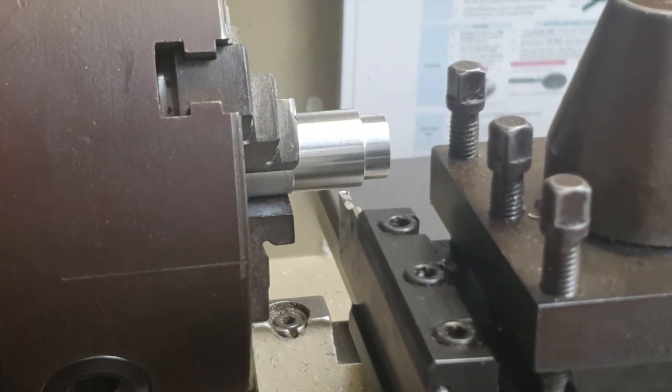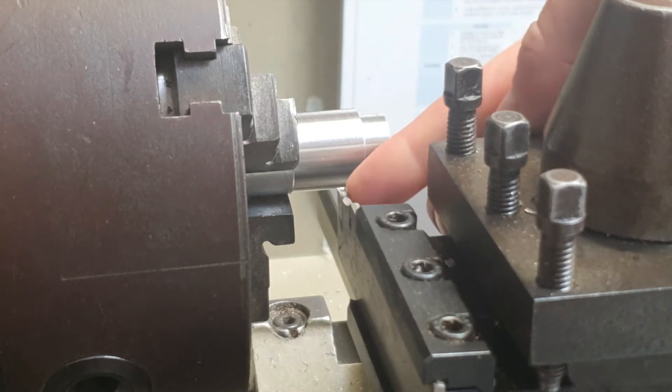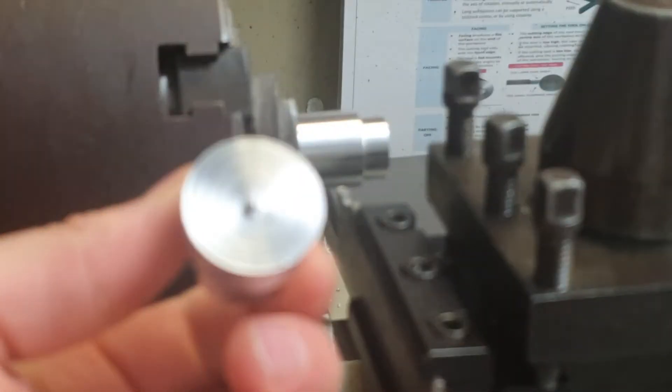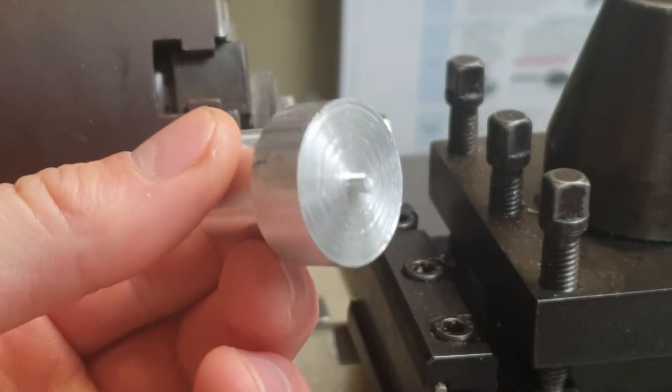It's this tool here — kind of like a blade, a blunt blade. We've got a tungsten carbide tip here that actually does the cutting. Parting off is a process that is done when we are finished making our piece and we want to basically cut it off the round stock held in the lathe. When we part off it should look something like this — you should always leave a little bit extra to part off because you're going to have to face off the back edge.